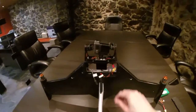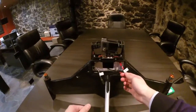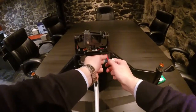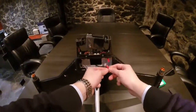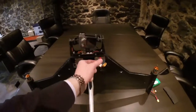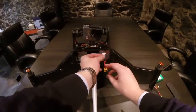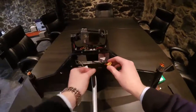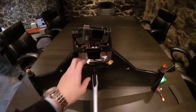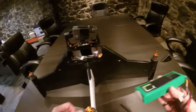That's plugged in. The next thing you want to do is connect the gimbal cable — there's only one way it can go in, it can't go in backwards. The red goes to the red, the black goes to the black. It slides in — make sure it's secure and tight. We're going to tuck this wire out of the way, same as the FPV wire if you're not using it. Now the next step is to install the battery.